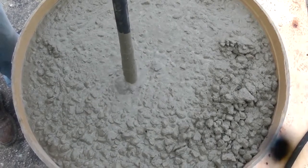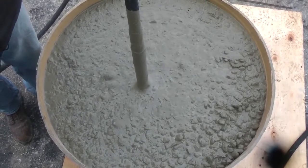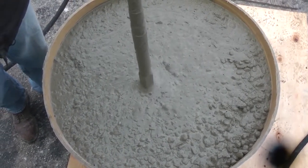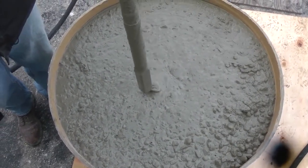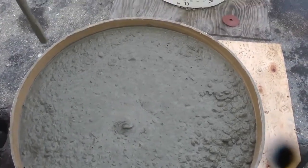The head should be quickly inserted into the concrete and withdrawn slowly, pulling and pushing the entrapped air off the concrete. The vibration energy, through a combination of frequency and amplitude, produces a consolidation diameter which can be seen with the human eye.